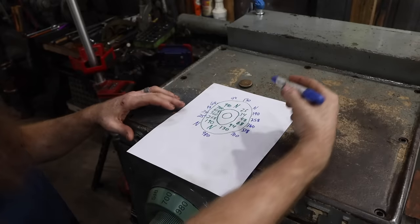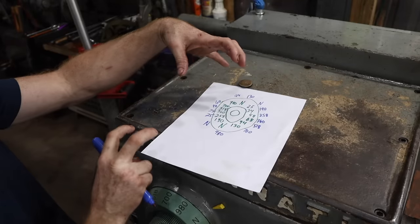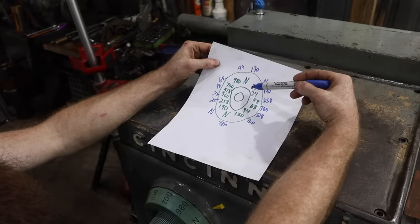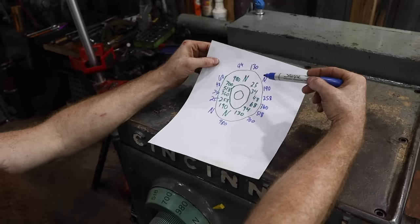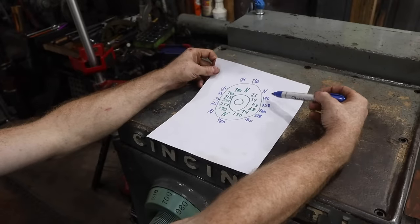So I can count that and I can know that when I take this head back off, I have to lift that off and I have to twist the gear inside the actual head with the shifter forks. We have to move this neutral here that sits next to the 190 down here. So we have to open up the head, undo the bolts, the gear in the head, I need to twist it.